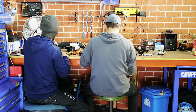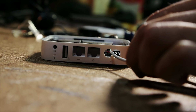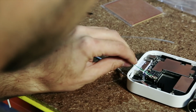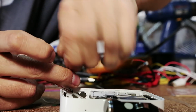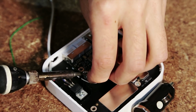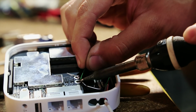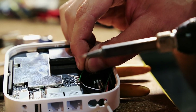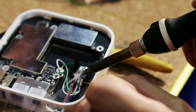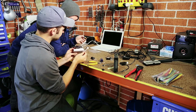We've installed our voltage regulator where the power supply used to be and screwed it down onto a heatsink. We're using spare wire from the USB cable and heat shrink on the connections to make sure nothing shorts out. We then connect the 5-volt source to the left pin, and the right pin will now give us 3.3 volts. The middle pin is a common ground for both sides of the circuit. The 3.3 volts and the ground wire are soldered to the Airplay circuit board where the old power supply used to be connected. We've put a diagram showing exactly how to do it on the Mighty Car Mods forum. Some hot glue helps to hold the cable down for strain relief.